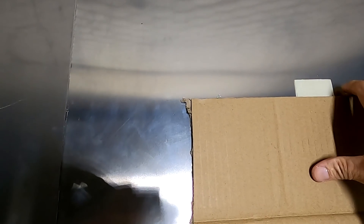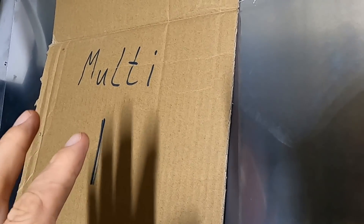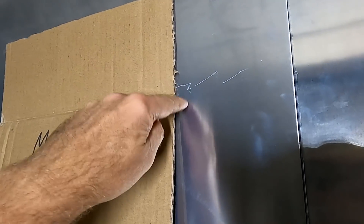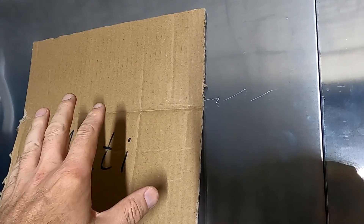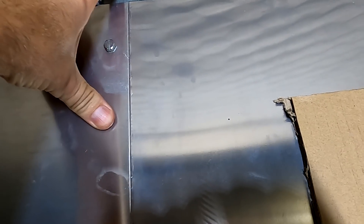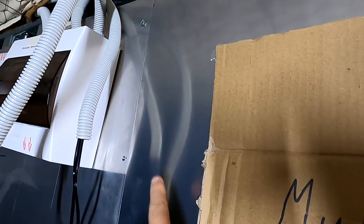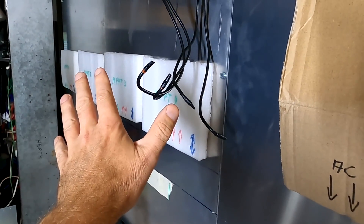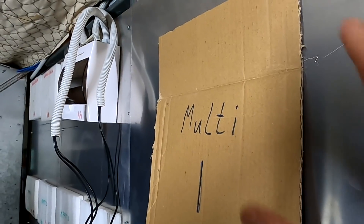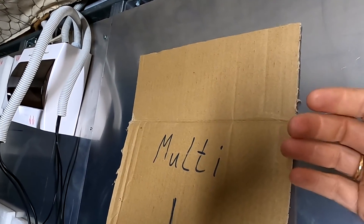The Multi-Plus is already coming down — these units are quite heavy, about 30 kilos each. They've got brackets at the back and I'm drilling through the material with nuts and washers on the back side. These brackets are only tapped M6 into the steel post, which is two-and-a-half millimeters thick. I don't want to use the same pattern as over there — I've got five screws in there which is totally sufficient for the charge controllers and switchboards, but these multi-plus units are sitting on this side of the panel and want to pull away from the wall.